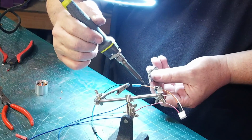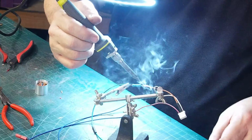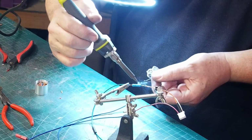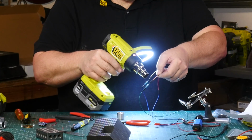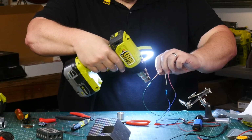And for each LED, I'm going to need to add a 1/2 ohm 2-watt resistor. Now I need to do that because I don't want to blow out the only 3-color LED that I have on hand. All connections have heat shrink tubing over them because once this mess of wires is crammed into the saber hilt, I don't want anything to short out on me.